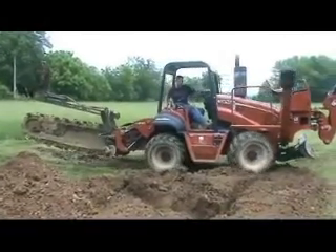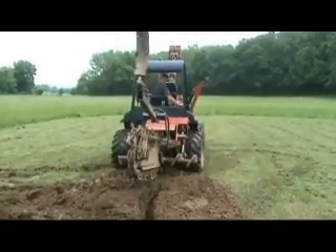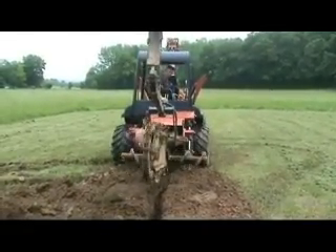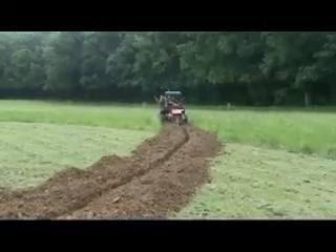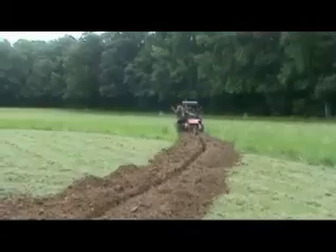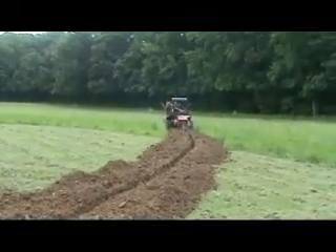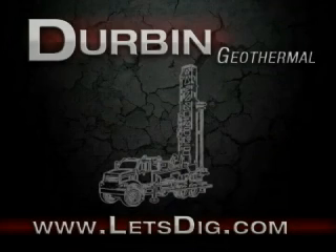This method of loop installation should not be used in pasture grounds or where children play, or other places where tripping and uneven dirt settling can be an issue. It also should not be used when a water line, electric line, pipeline, or fence must be crossed multiple times. Here you can see he's already dug the header pipe out and now he's trenching in a fan shape — or a peacock shape. He's got the first one in, and we're coming up on our three-minute mark, so we'll save more for another day.